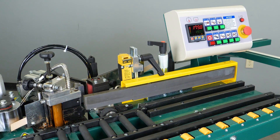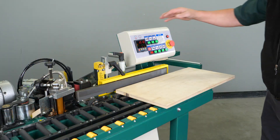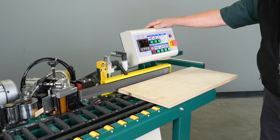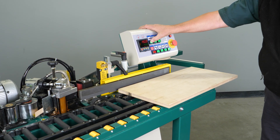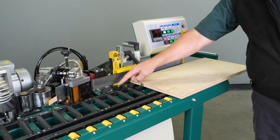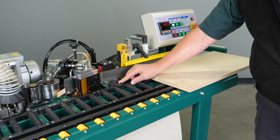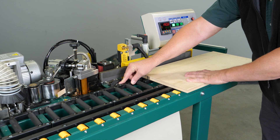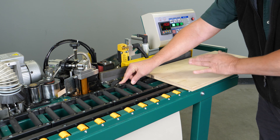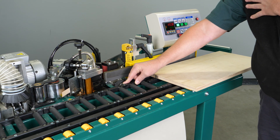Now we're going to talk about the first button on the control panel, which initializes power for the guillotine assembly to work properly. When I press this switch, it puts power from the PLC to the first roller switch on the table assembly. Pressing the switch simulates a panel rolling over the tabletop. As the panel continues forward and the end of the board allows the switch to release, that will actuate the guillotine assembly.